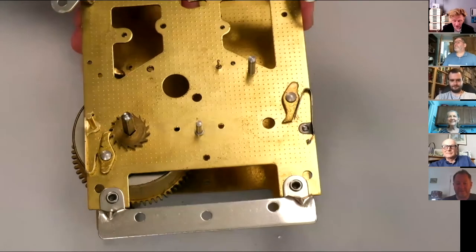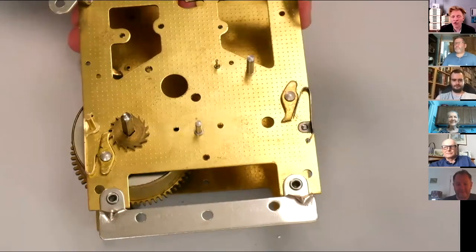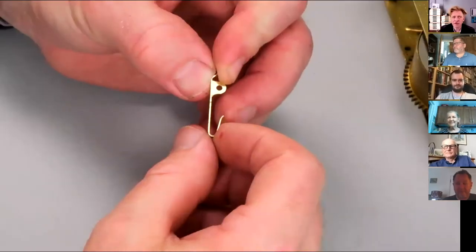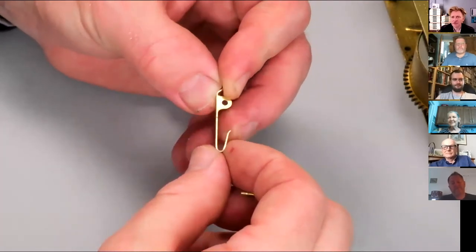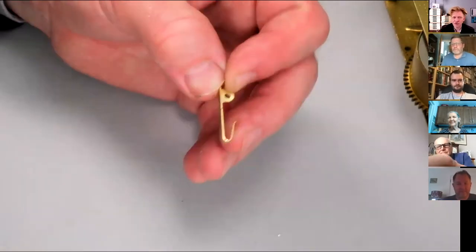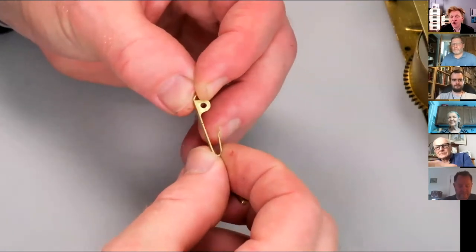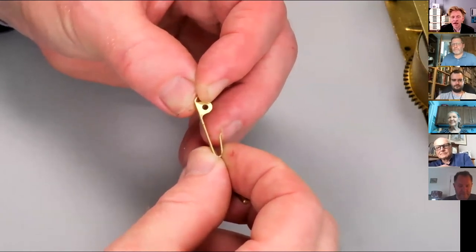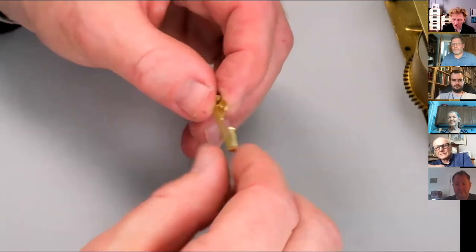So we're really nearly there. What I'm going to do now is we talk a lot about the manipulation of materials. So in this series, we'll talk about it next week a little bit as well. Again, really useful. We've done things like hardening and tempering steel, which sounds like something from outer space, but you can do with relatively simple tools. And here, you see this piece of brass, which was soft. We hardened it and it's now springy. So we work hardened it. We just did that by hammering. So you can manipulate materials to do what you want.